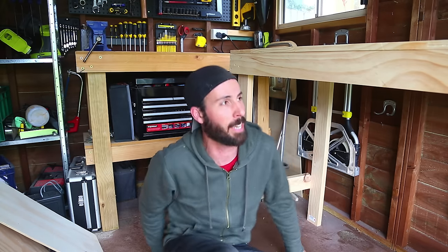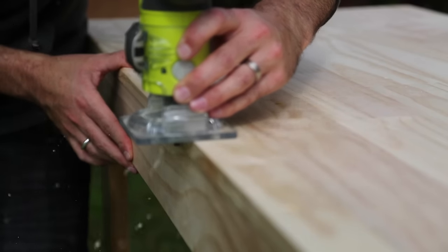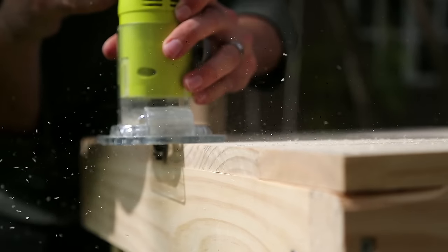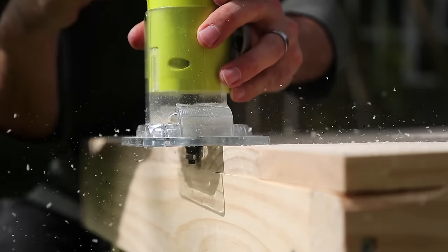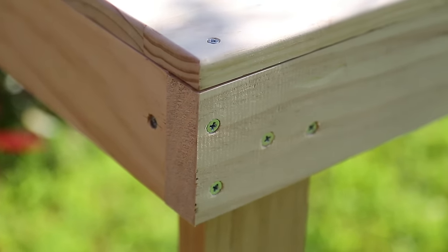With this one here, I'm actually going to be having a rolling tool chest under here, so I don't want any shelves there. But one nice tip that will make it a much nicer workbench to use is just to bevel the top edge along here. You could use sandpaper, or something like a router with a round-over bit, and just go along that front edge so you're not always leaning against a harsh corner. So that is how you make a fast and budget workbench.